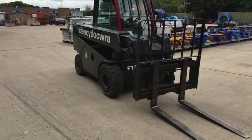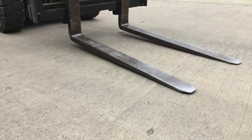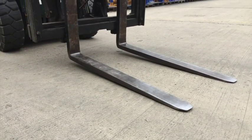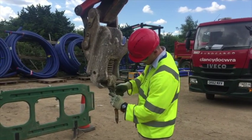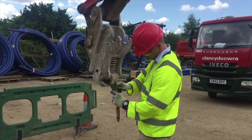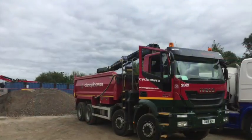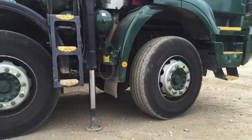With forklifts, the load must be lifted from a properly designed lifting point — not by hooking chains onto the forks. Forklifts with telescopic handlers should avoid travelling with suspended loads due to the high risk of instability. When using excavators, the bucket must be removed to improve visibility, reduce the weight being lifted and to avoid snagging the chains. If this cannot be achieved, the excavator is deemed unsuitable for lifting. Grabs must be operated on firm level ground, with outriggers properly deployed and tyres correctly inflated.